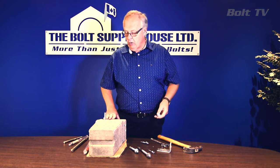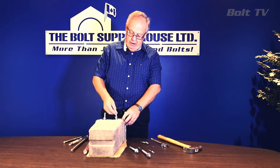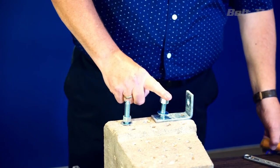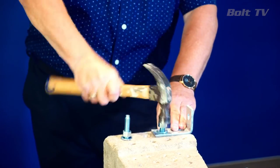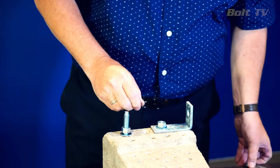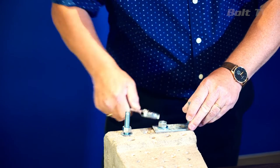Once we're ready to fasten and our hole has been prepared, we put our fixture typically in place over the hole. Install our wedge anchor by putting it into the hole — it will hang up on the hole because the clip is slightly larger, and that's a good sign. Then with our mechanical hammer, pound it in. Once the anchor has come flush against the fixture, we use a wrench — three to four complete revolutions of the nut — and that clip will bear out into the concrete creating our bearing surface.